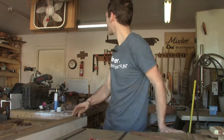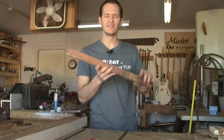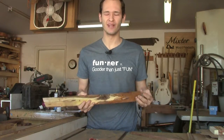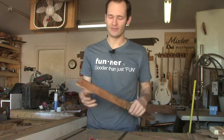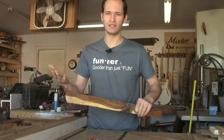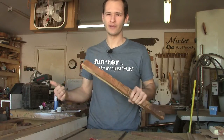I picked out a piece right here. This piece is kind of rotted and cracked and otherwise would have to be cast and stabilized. I'd rather make him a pair of drumsticks, so I'm going to take this face right here and cut a 5/8 inch strip, then square those up on the table saw, and then turn them on the lathe and finish with probably a friction polish — something light.